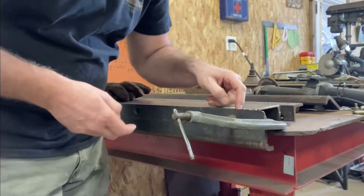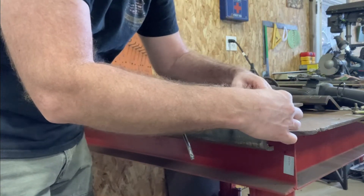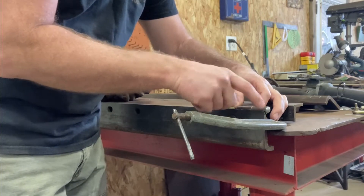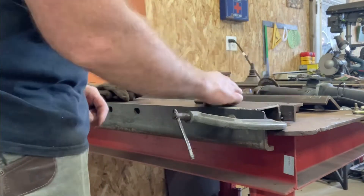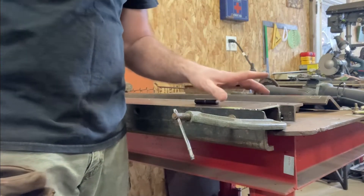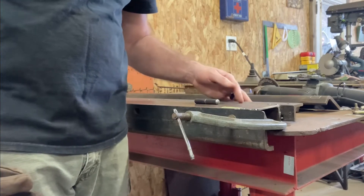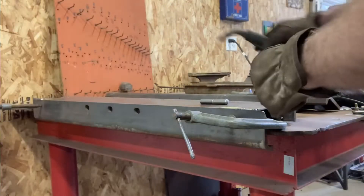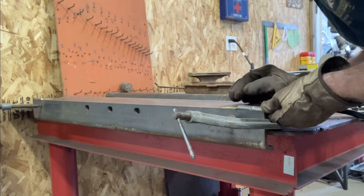After I notched these two plates out here, I got this old pin hinge that'll fit right in here like so, and I can weld this end to the base and this end to the bending part on both sides. I also tacked on another little piece of angle iron on the back here because my top plate - my clamp plate - was just a little bit wider and it had a tendency to catch up on the edge of this C-channel, so I gave it a little bigger deck. I do need to make sure that this hinge is approximately halfway down.